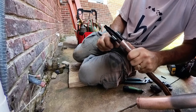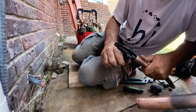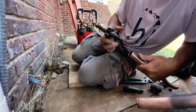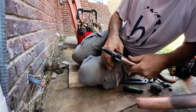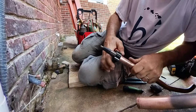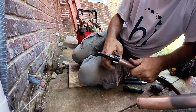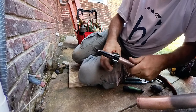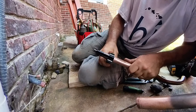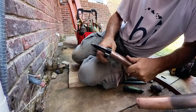I've had them split before. Usually it's because I tried to take too big of a bite. You can see here as I do that, it just makes it nice and round. Then you flip this thing over to the next size and start expanding. I'm just going to work it little by little — I'm not going to take big bites. I'm just going to keep moving the tube around. Whether it's in your hand or mounted, it's the same thing — you keep rotating the tube and the tool. You can see how it's starting to expand.